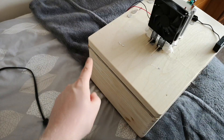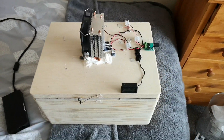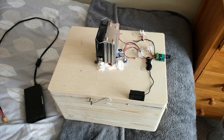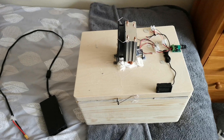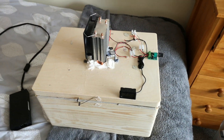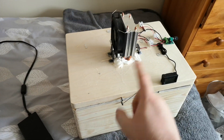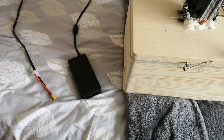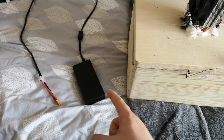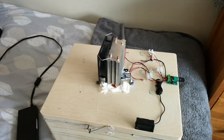The XT60 plugs into the back there. For the actual Peltier device, I decided to spend a couple quid more and get a standard-size unit but rated at 10 amps, to see if that would increase the cooling potential. I don't have any current reading devices to confirm it's actually pulling 10 amps. If it is, adding about half an amp for the fans, that's 10.5 amps total on a 12.5-amp supply. I'd expect the supply to get modestly warm, and it does get warm, but not as hot as I was expecting. That could be a good power supply, and maybe I'm overthinking it — but regardless, it does work in the end.